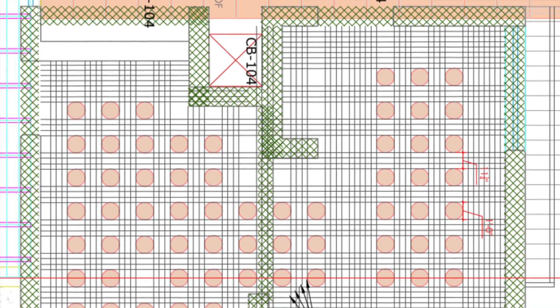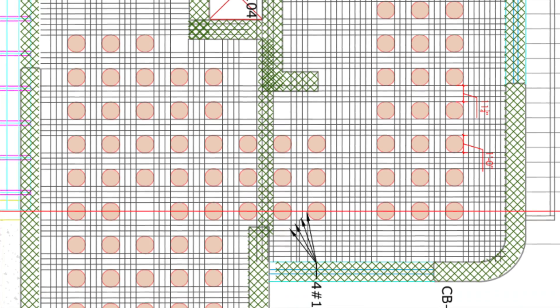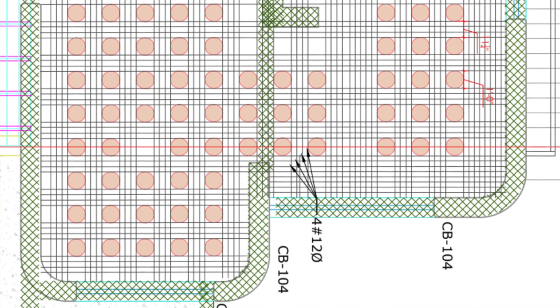Here in Ananda, we've placed the pots at a center-to-center distance of about two feet. The pots are about 10 to 11 inches in diameter and about 3 inches in height. That much volume we've reduced from the concrete, so we end up saving on material.